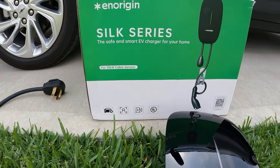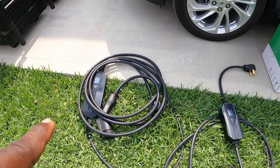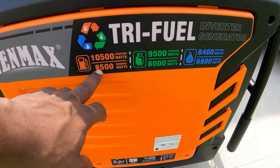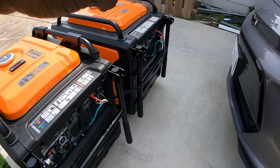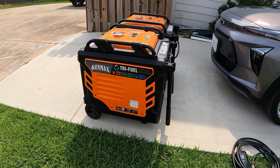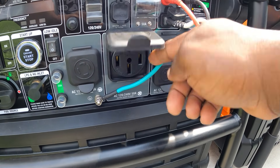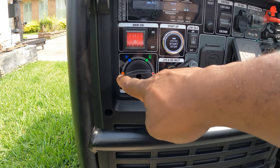This one puts out 10K. The adjustable one — I'll go through it with you guys when I plug it in. And this is a 40 amp charger. You cannot run Level 2 40 amp on a single generator, because Level 2 pulls 9,200 watts and this one only gets 8,500 running. So what we need to do is parallel these two. I also want to show you guys you can parallel the 10,500 with the 9,000 — a subscriber named Gil asked me that. The GenMax has a 50 amp plug so you don't need a parallel kit, just a parallel cable. Let's fire it up and do the test on gas.